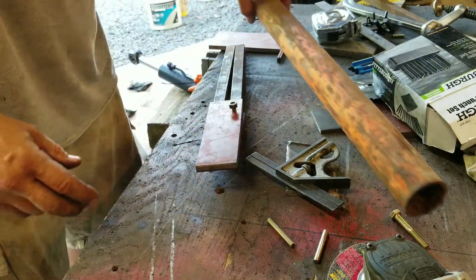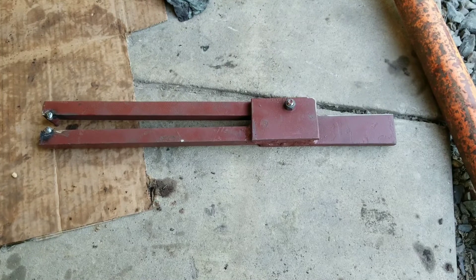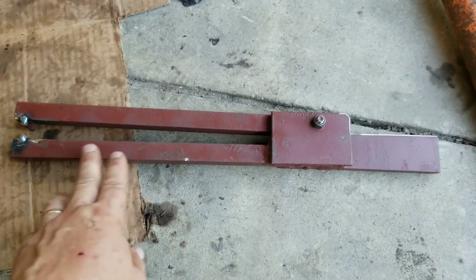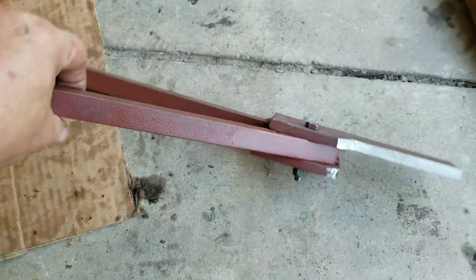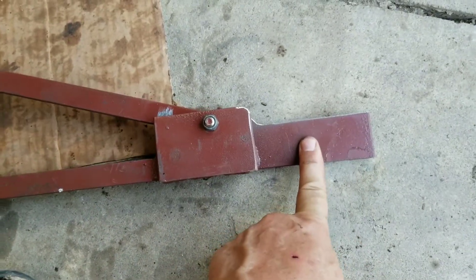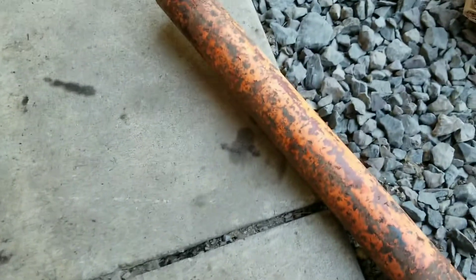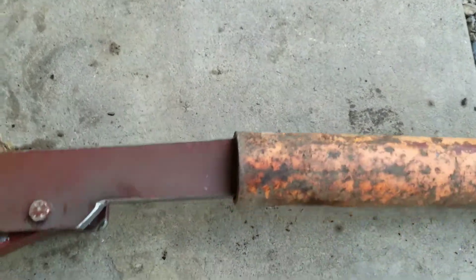That's the goal. I've been at this about an hour now. I pretty much jumped ahead and finished it, so I'll just detail a little bit. Three-quarter inch square rods, 14 inches long. Three-eighths of an inch plate. This is seven inches here, and an inch and a half — and that will fit right into there.